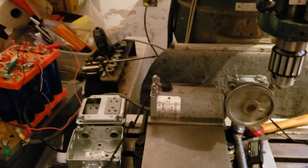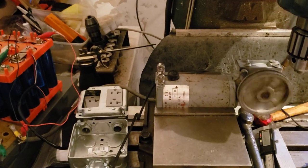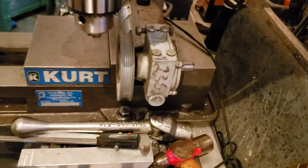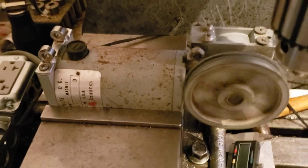Some experimentation here on making a capstan windlass type tensioner. Got a little battery, amp meter, whatnot. But the important part is I have a motor — it's actually a pretty old electric wheelchair wheel motor. It's a 24 volt motor with a little worm drive in there.